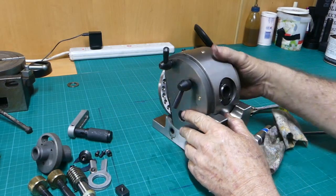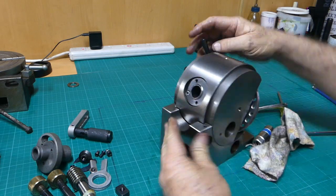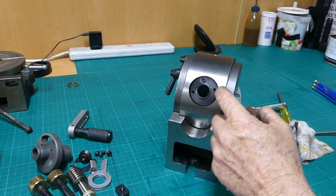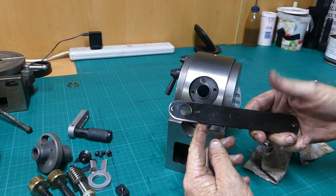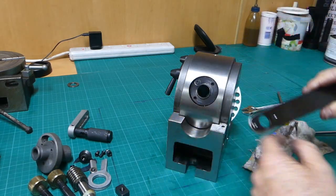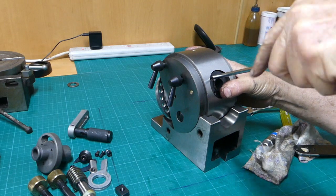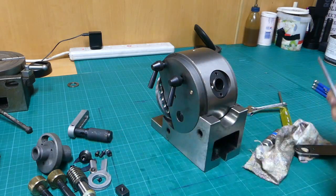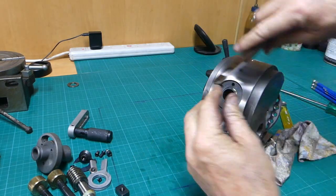Right, because we've got the dovetail there. But what it will do for us is where this spindle is, if I undo the spindle there, so that turns. Now, I had a look at this before I started pulling it apart, and I thought I'll see if I have a pin spanner, and I didn't have one, so more luck than good management, one of my Makita spanners fitted it. I just rounded it off a little bit. So we'll pop this locking screw out. I'm not sure how the shadows are going in that monitor, but anyway, it'll either be good or it'll be bad. So I might lock that spindle in any old hole, any port in a storm.